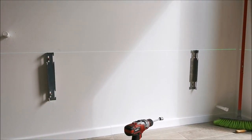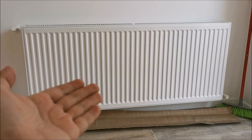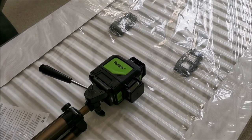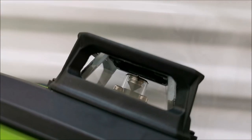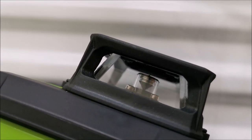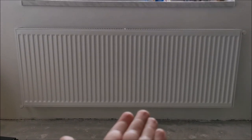At the moment I'm only using the horizontal line because I don't need the center anymore; these things are in place. So I will continue installing the radiator — everything is level and where it should be, so everything will go together. Radiator onto the wall and perfectly level. Having finished one radiator, going up to another room to do an even bigger one. While carrying this on my cheap tripod, I realized that the part protecting the laser is actually glass, not plastic — you can see tiny bubbles where the glass facets are glued to each other.